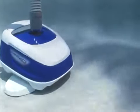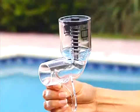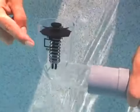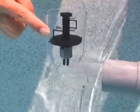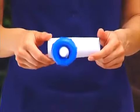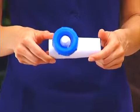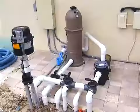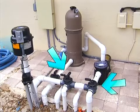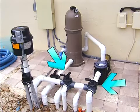Observe the operation of the Navigator Pro and note the reading on the flow gauge. Should the reading not be between the min and max box, it will be necessary to adjust the water flow through the cleaner by using the V094 regulator valve, a Hayward skimmer vacuum plate, or valve or valves in your filter system that are installed for this purpose.